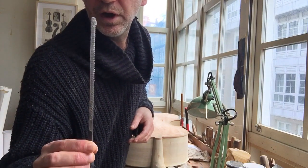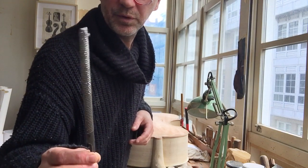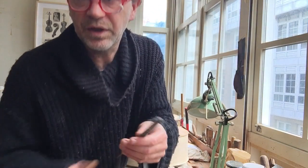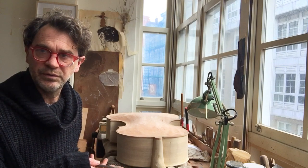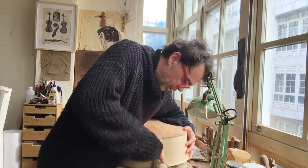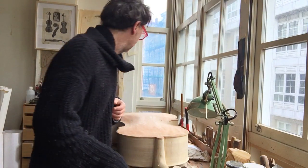When you're working on end grain it's really difficult — if you try to cut the grain on the end in carpentry it's very hard. I found that rasping is the easiest. This is for your tool list: this is a smaller rasp you're probably going to need. If you don't want to go to Bolstner, you can go to Gerstner in the Margaritenstrasse — that's where I got this one. The rasp really doesn't care about the grain or the direction, so you get a really smooth line.